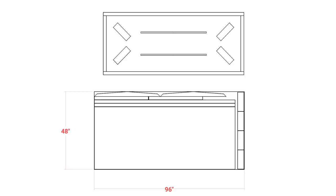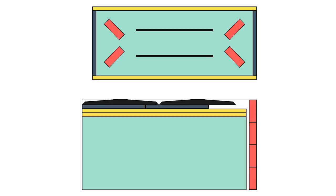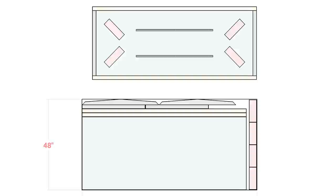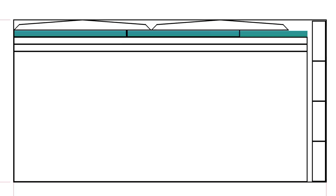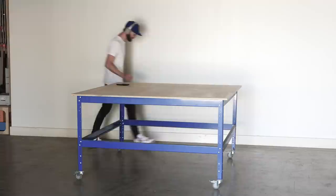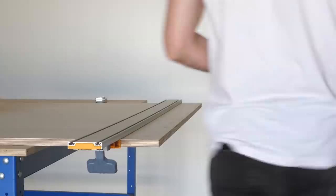In this drawing you can see our pieces of plywood with the pieces nested in it, as well as an underside view of the assembled tabletop. I'm going to quickly color code everything so you can get a rough idea of where each piece is going to come from. In terms of order of operations, you should start by cross cutting a section so that you're left with a 90 by 48 inch chunk. From that, rip three strips at two inches wide, then one strip at three inches wide, and whatever's left is going to be your top.